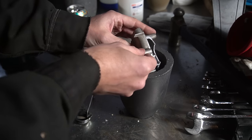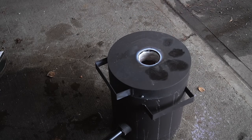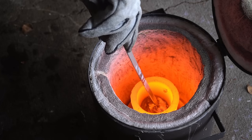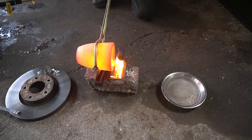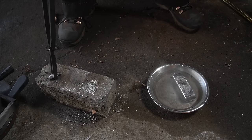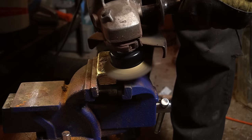And finally, what a lot of people will probably want this for — the most common metal in the world — aluminum. I'm using some high quality cast aluminum that came off of that same motor. I don't want to be mixing different aluminum grades. We can experiment like that later on. This, unsurprisingly, worked great, and it took 5 minutes or less to get this crucible fully melted. There wasn't even much slag I had to clean off, and I think that's for two reasons. Number one, it's a fairly oxygen-starved environment, so the aluminum shouldn't be able to form too thick of an oxide layer. And number two, I specifically chose high quality casting aluminum. And there we see proof that even an idiot can get pretty good results the first try with this tool. Hit it with a wire brush to clean it up, and beautiful.